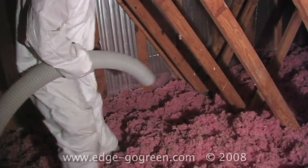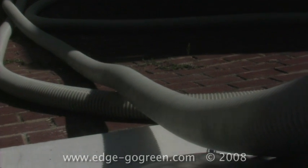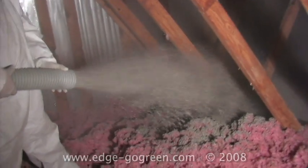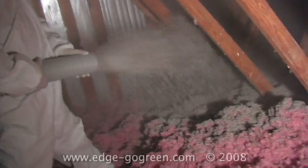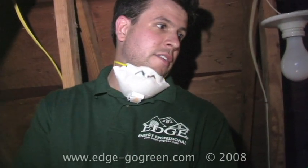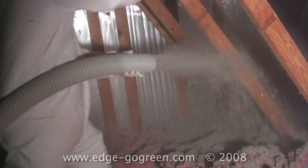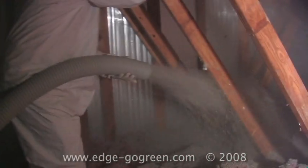As you see, we've got insulation, and specifically blown cellulose material, blown throughout the attic. This was sort of a coup de grace step as far as all weatherization goes, because now that we've got it up here, we've got between 17 and 18 inches. We blow a little bit extra on top of R50 in case the insulation settles down. You see how much more difficult it would be to move or gain access to different sides of the home. This is a great material.